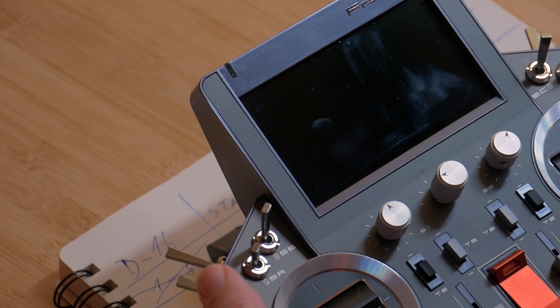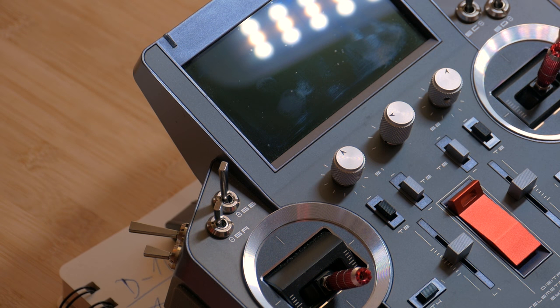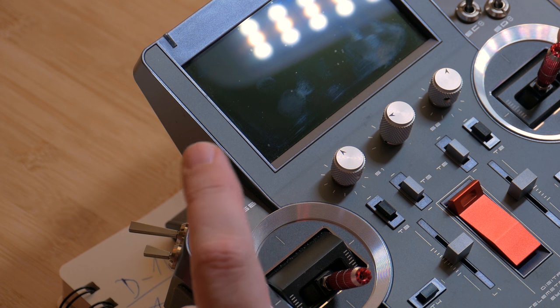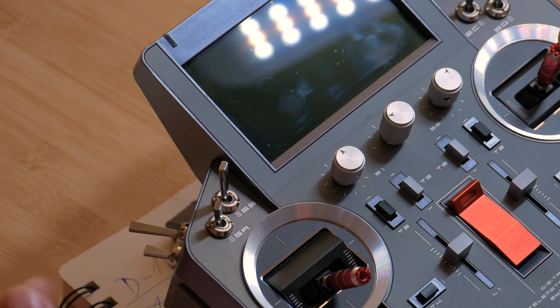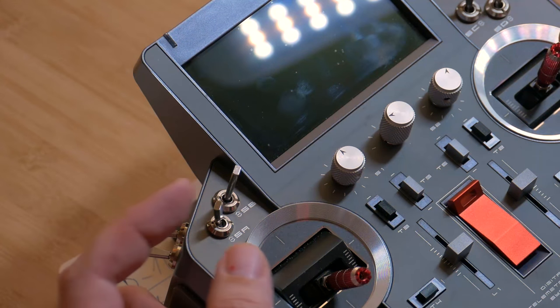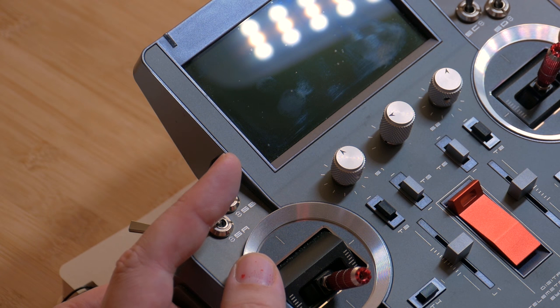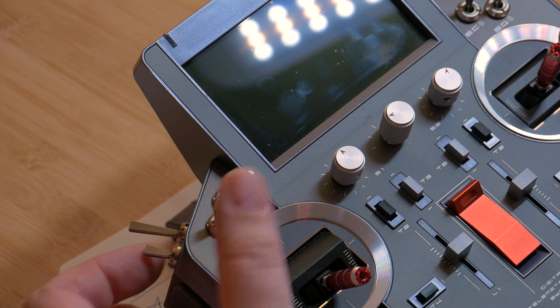the transmitter and model without some servo reversing on channels, minus 100 value is up position of switch, 0 is center position of switch, and plus 100 is bottom position of switch.